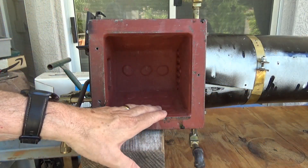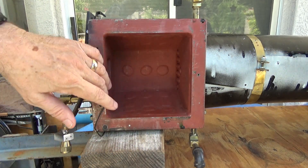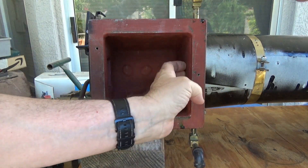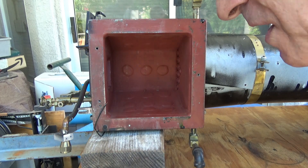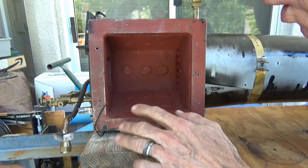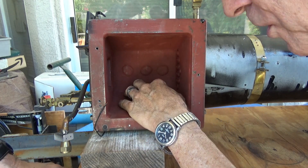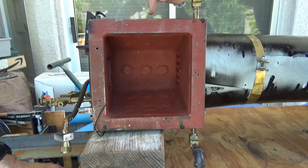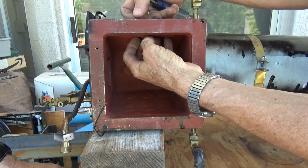Now here's a view we don't often get, Bob. We're looking up into the firebox. So give us an idea of what's going on. There must be a jacket of water here because clearly the boiler does not come all the way down here. That's correct. Now what you see is an unusual opportunity to look inside the firebox, and this is true for both the model locomotives and their prototype locomotives. This is actually a double-walled environment. You've got the wall you see here with these big round welds for the stay bolts that pass through the wall. So there is a piece of plate on this side, a piece of plate on this side, and these stay bolts pass through and get welded on each side, keeping the walls from bulging out.